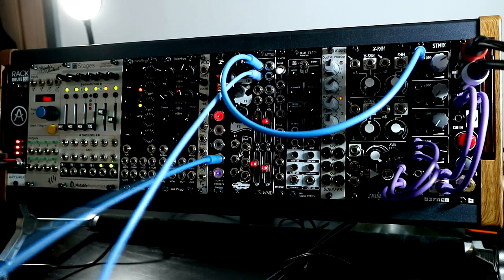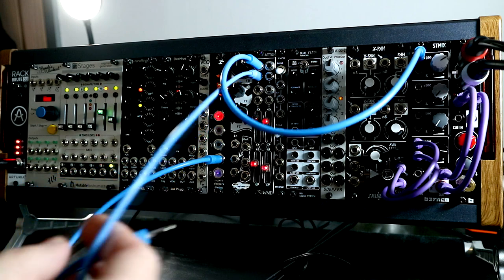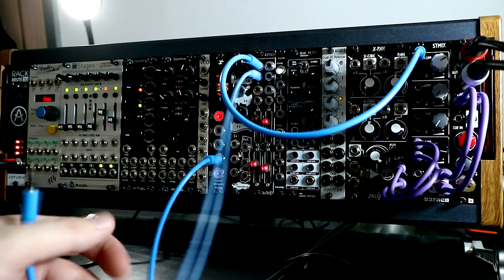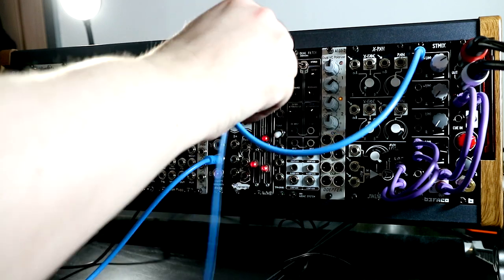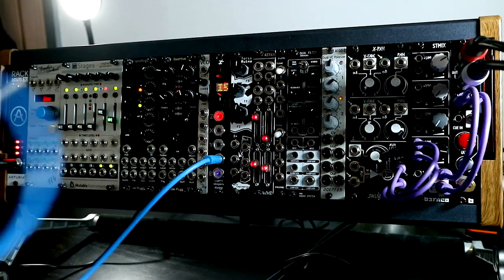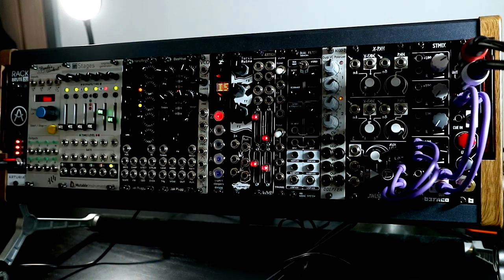Good. As I say, you've got no gain control there, but you could put this through a VCA, and by lowering the gain with the VCA, you could lower the amount of distortion. What I really love this for is that because you have these different circuits here, you can multi-signal to these various different circuits, and do stuff like pinging and panning.